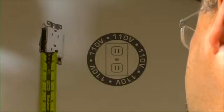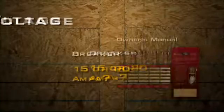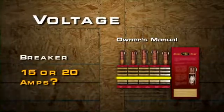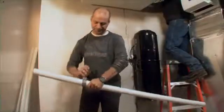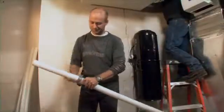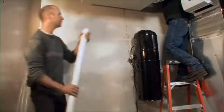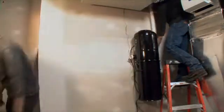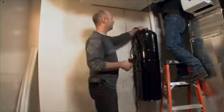Speaking of electricity, have your electrician check the circuit breaker connected to this jack. It must sustain adequate charge for optimal unit operation based on the chosen 15 amp 120 volt or 15 amp 240 volt. Lastly, since the location is contiguous to the back outside wall, it facilitates the connection of the mandatory outside evacuation system necessitated in energy-efficient homes of NovoClimate standards type.